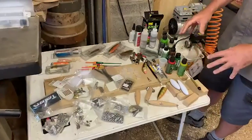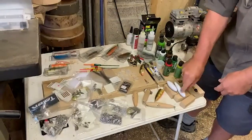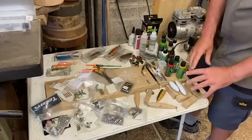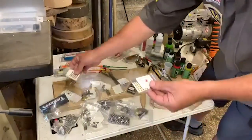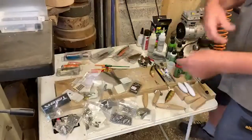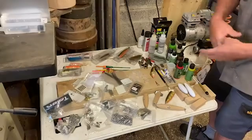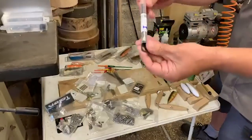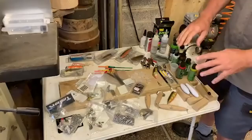Over here is our airbrushing equipment. Because of the amount of airbrushing, I've already prepped and turned a couple of pieces that have been primed with white paint. Eyes are very important — I've got different packs of coloured eyes. You put those on before the epoxy. So: turn it, drill it, prime it, airbrush the colour, put the eyes on, then epoxy. I keep a good set of lip-and-spur drill bits specifically for this, as the hole needs to be very crisp and clean.